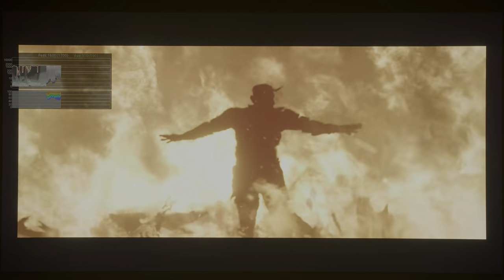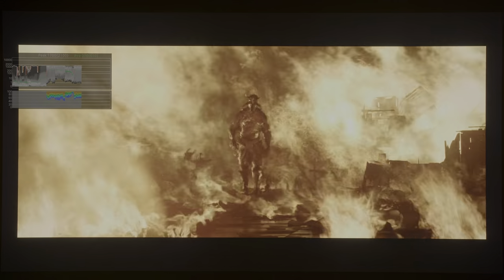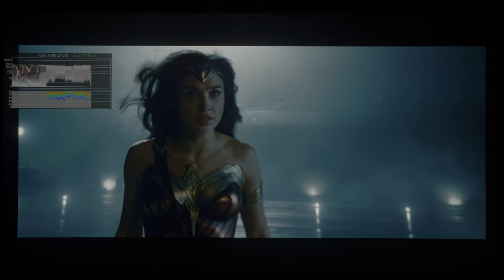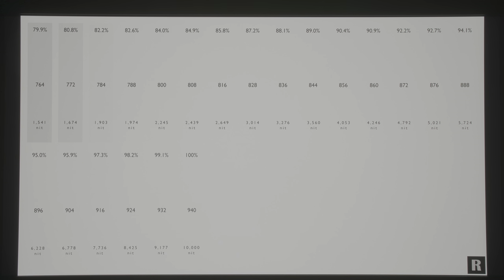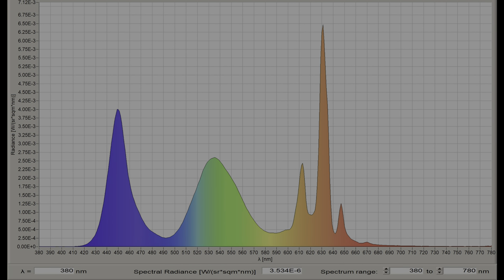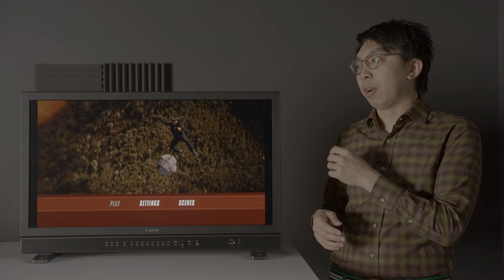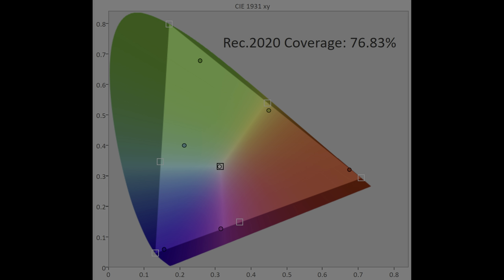In the final act of Wonder Woman, where the roaring fire and explosions frequently go above 1500 nits, we could literally feel the heat when watching the monitor — and not because of Gal Gadot either. Because IPS panels suffer from brighter blacks inherently, shadow detail appeared more compressed near black, while at the other end of the contrast ratio spectrum, the DPV3120 hard-clipped at around 2000 nits, which is the correct behaviour for a mastering monitor. The wide colour gamut capability is provided by PFS Phosphor, judging from the spectral power distribution captured using our Jeti 1511 spectroradiometer, allowing the Canon DPV3120 to reach 97% of DCI-P3 and 77% of Rec. 2020, both in uv terms.